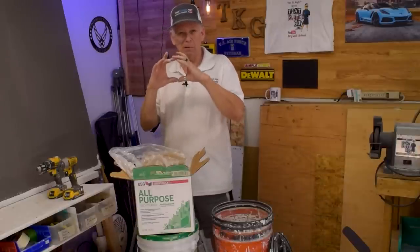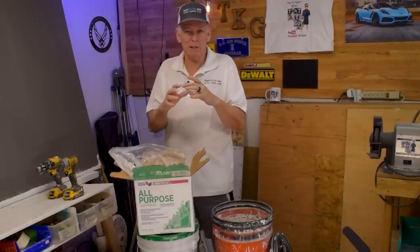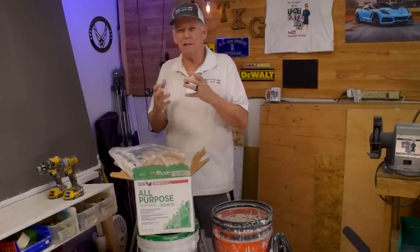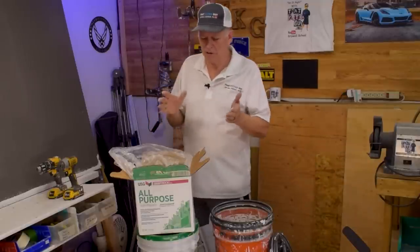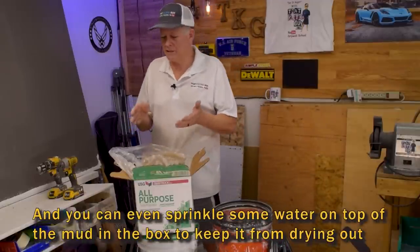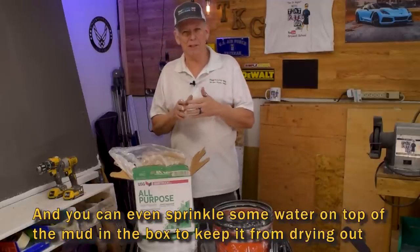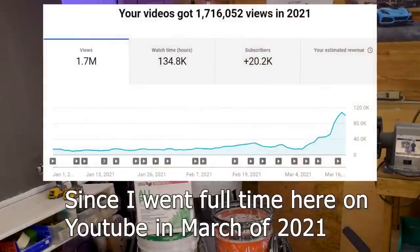I don't recommend working out of the box unless you're just needing a little bit of mud now and then. In that case, you might want to buy one of those little tubs — you can get a small tub of drywall mud, or some lightweight spackling. They'll stay fresh a lot longer. If you're just going to do a little repair, that'll work. But if you're going to break out a half pan of mud every now and then, it can work — you're just going to have to throw a lot away.